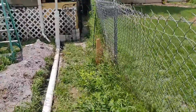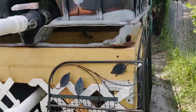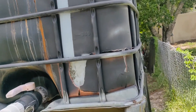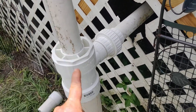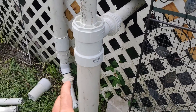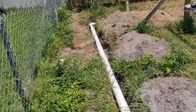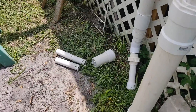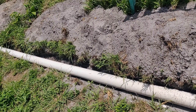Two 250-gallon tanks with just about 200 gallons in each. I've got two two-inch pipes starting off tying into a four-inch pipe. Two two-inch pipes do not equal four-inch pipe in volume, but by necking it down to three-inch down there I'm good — I just created an extra.